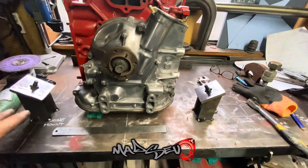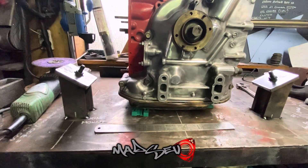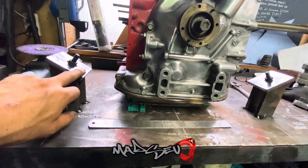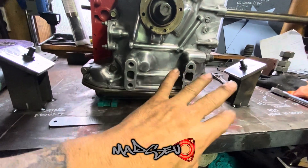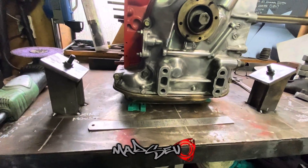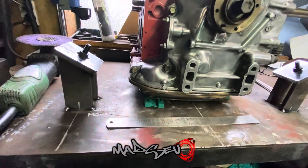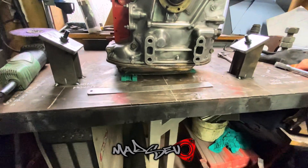This is what I had in mind from the start — to mock these up so that essentially this is how the engine is going to sit in the engine bay. These heights have all been shot with the laser, and that's the angle. All I have to do now is build from this point. That's bolted down solid, and I'll pick up these points and design it however I want. I know I have plenty of room coming forward, so I think it's good to go — I just need to constantly check the dimensions from this angle at the back just in case the engine moves.